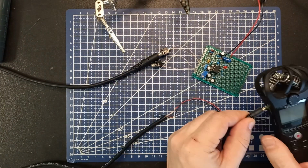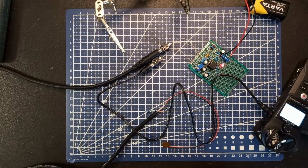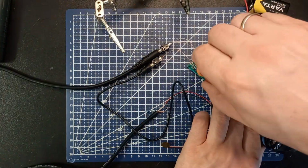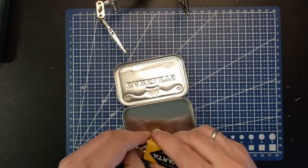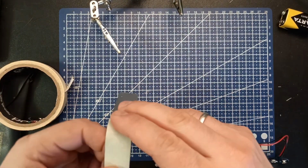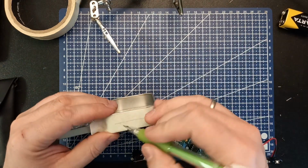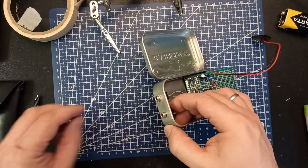Another thing is that a standard shakuhachi has its lowest note somewhere around 260 Hz. It is not reasonable to set the cutoff frequency lower than 200 Hz. So, the final version will have 3 feedback pairs corresponding to gains of 10, 15 and 20 decibels.